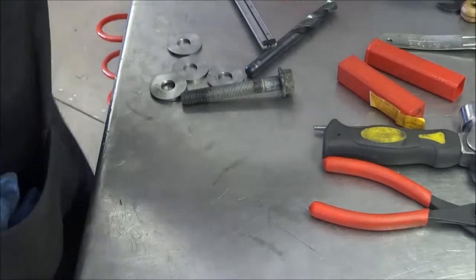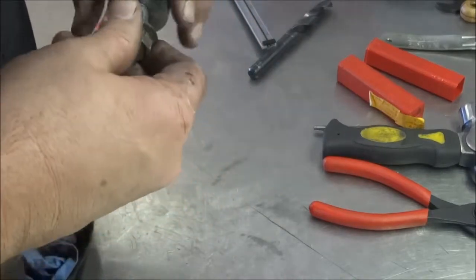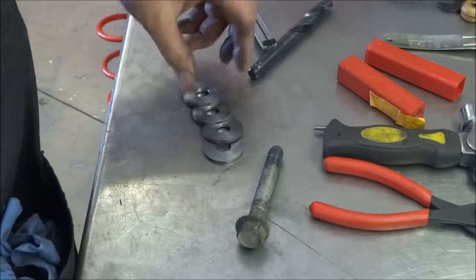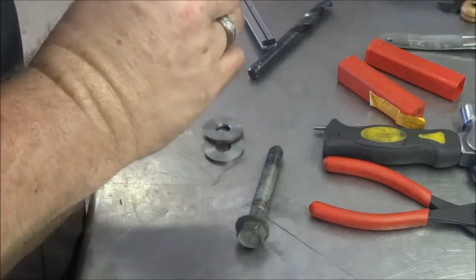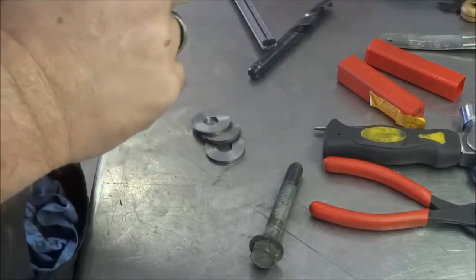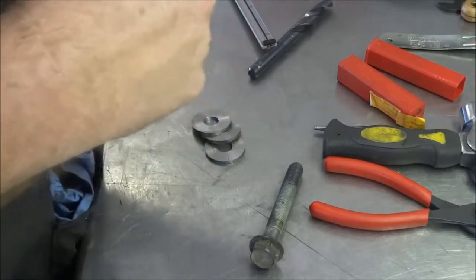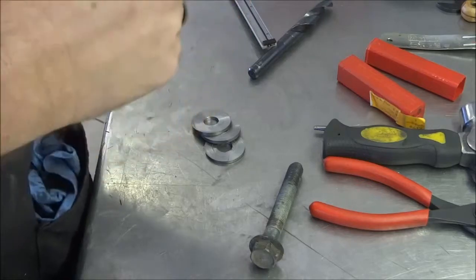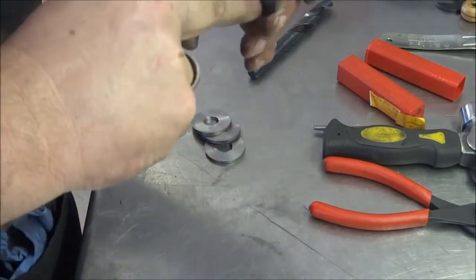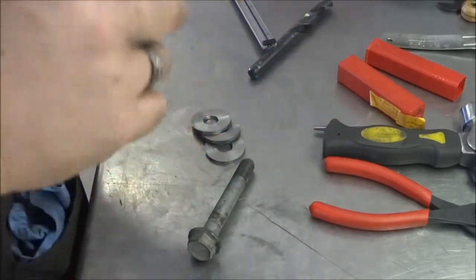If it were more critical I'd give myself a few thousandths for a face cut, but on a spacer like this just to clean up slop in those bolt holes — there's no slop now. That was worth the 10 minutes it took to machine them, plus probably five minutes to weld them on. I'll put the bolt through with a nut on either side to tighten it in place and put a weld down either side. I also ran a hand chamfer to knock any little ridge off — but don't take too much chamfer, because you're moving that edge and reducing the surface area supporting that bolt.